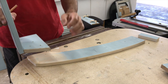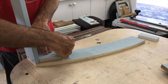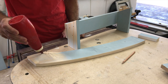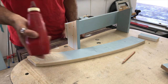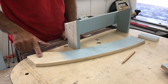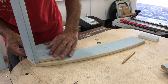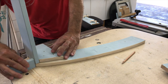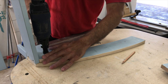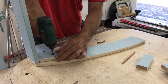The front and back leg assemblies could then be glued and screwed to the side rails to complete the footstool frame. Again I removed the primer from the glue surfaces so that I was gluing wood to wood. I used the nail gun first to stop the pieces from sliding around and then finished off the joint with screws.